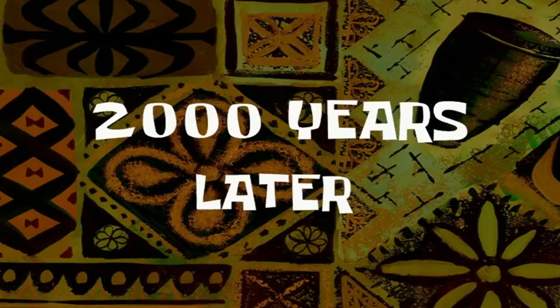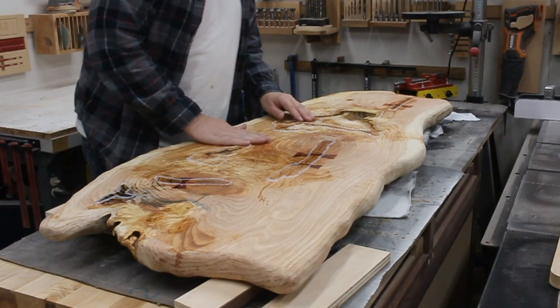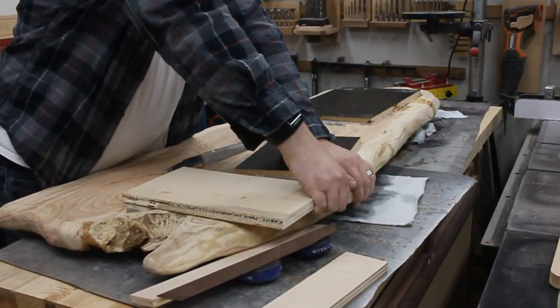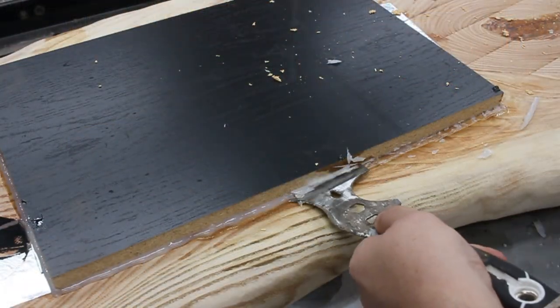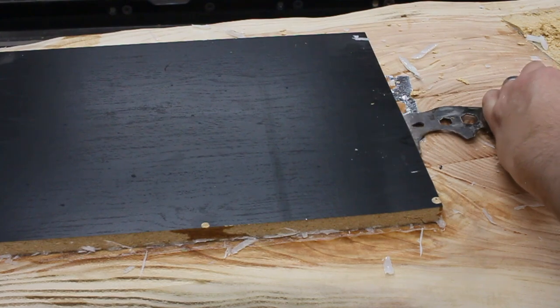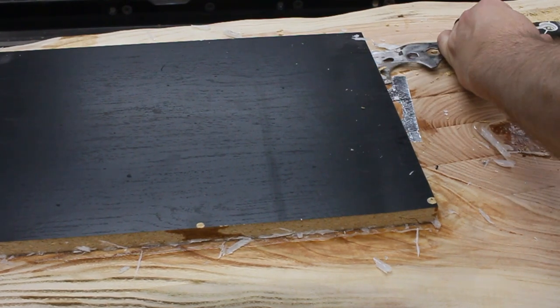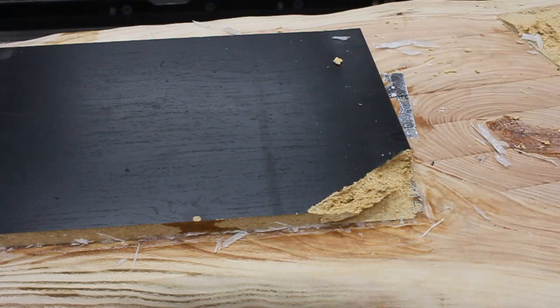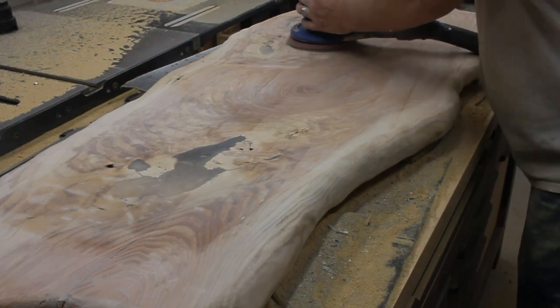It was pretty fun to fill up all the cracks and holes, just not so much fun to pick out all the little floaties that came up. I popped all the air bubbles with a torch and then stole my wife's heater so I could bring the temperature in the shop up to 76 degrees, which is what the instructions said was optimal for the epoxy to set. Two thousand years later — once it had all dried, I flipped the slab over and attempted to pry off the pieces of chipboard from under the two big knotholes. I had to chisel them off piece by piece, but eventually I got the underside of the slab clean and sanded smooth.